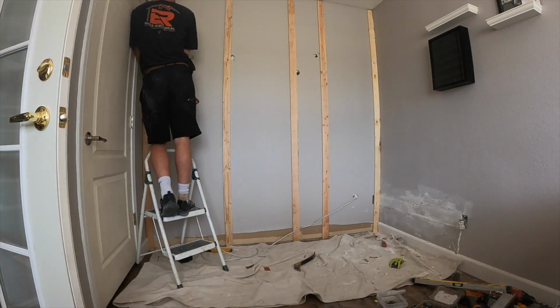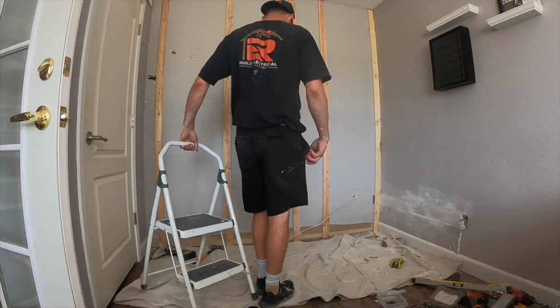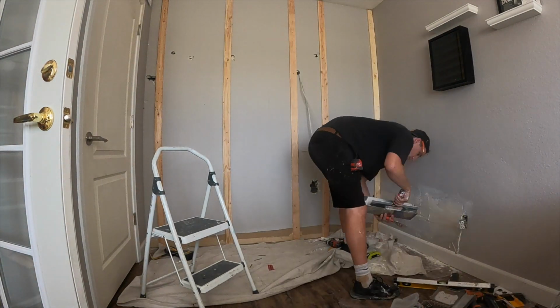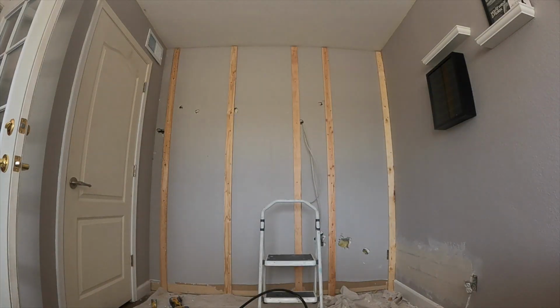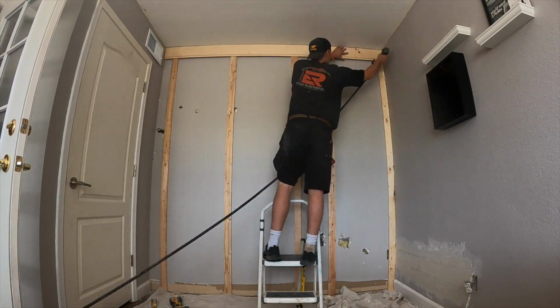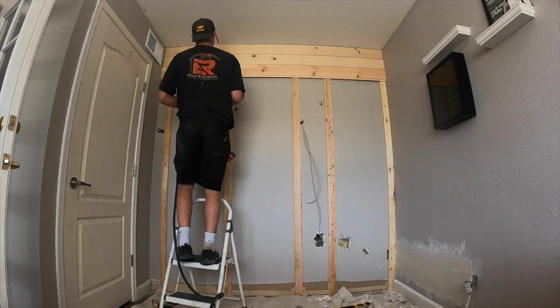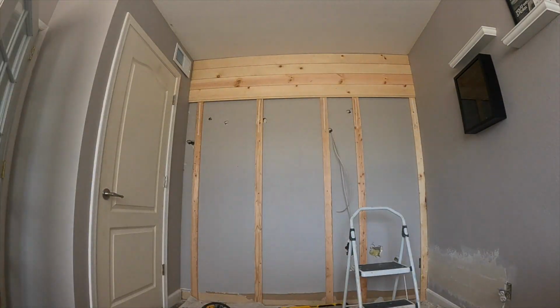And this is also a really crucial tip right here. Screw your boards in. Always screw them in, because if you apply shiplap to drywall, you don't really know if the studs are straight behind the wall. So sometimes you can miss and not actually get a good connection from shiplap to stud. So by using these 1x3 strips, you're always guaranteed a nice solid nailing connection.